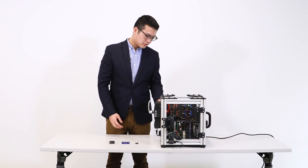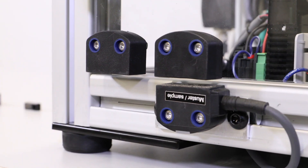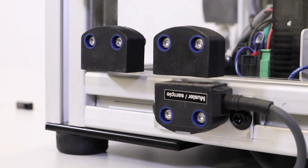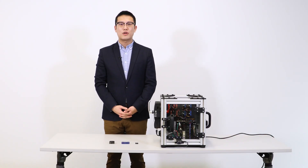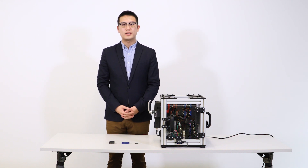Now what I'm going to do is demonstrate how to teach a new actuator. To do this, I'll begin by turning the power off and positioning the new actuator in the detection range. There is a good amount of tolerance, so the new actuator does not need to be perfectly aligned. Next, turn the power back on and notice the flashing red and yellow LEDs.